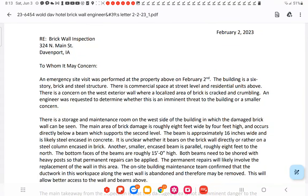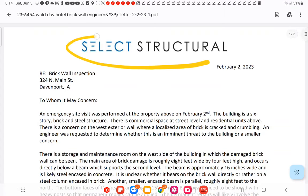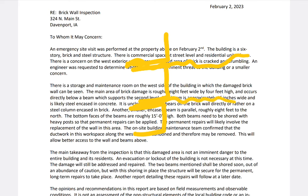Let's go back in time. The bricklayer that did the first set — I like the way his brick looks, except for the cold joints. There's nothing tying to the existing structure. It's like he got paid to do right up to here and that's it. That creates a problem with the existing structure because there's no interlocking going on.